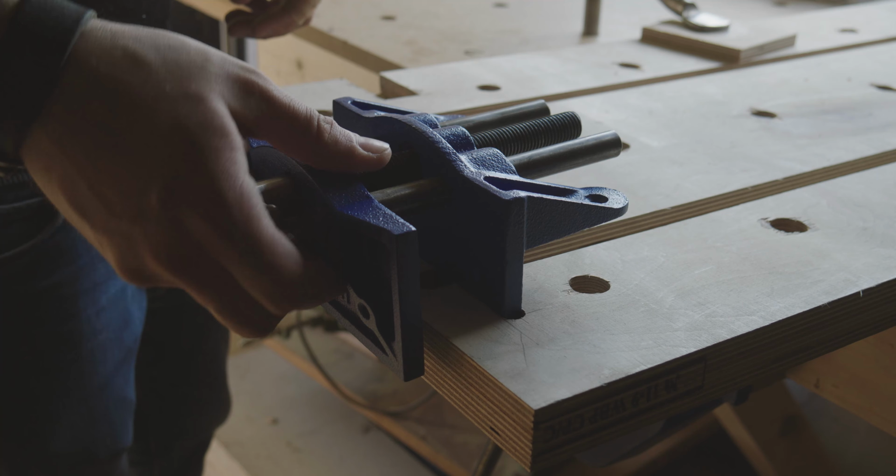One of the grooves is not milled over the whole length of the panel. This is where the vise will sit later on, and so that I don't make any dents with the rails or the hole when I clamp something, I'll leave the rest. To make sure that the rail sits neatly in the groove, I just chisel the radius left by the router.